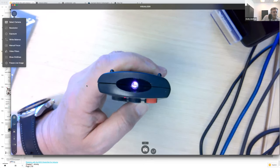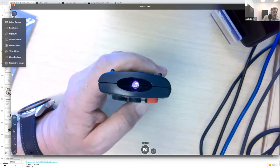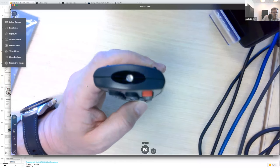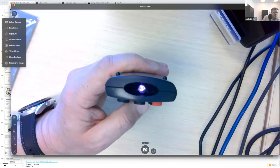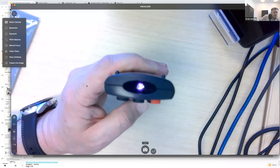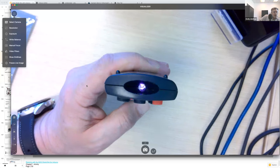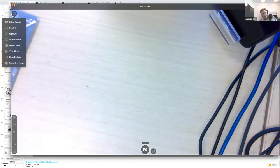And that's the camera kind of sampling, since it's flickering at 38 kilohertz and then taking 0.6 milliseconds break between its flickers. You're kind of sometimes catching it on and off, and it looks like it's visibly flickering in the screen, but it would not be detectable by the human eye. If you put a red light there, it would just appear to be dim. Yeah, thanks for mentioning that.